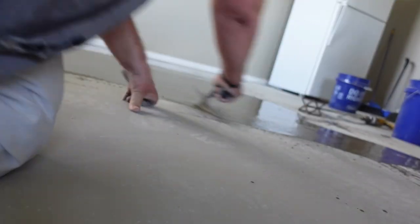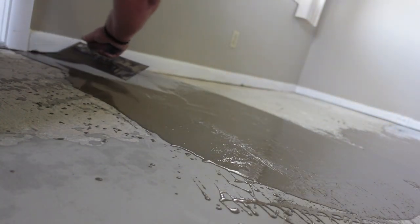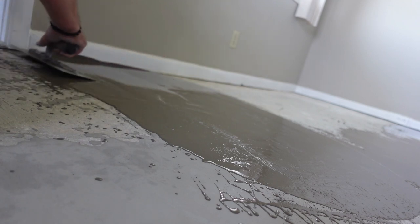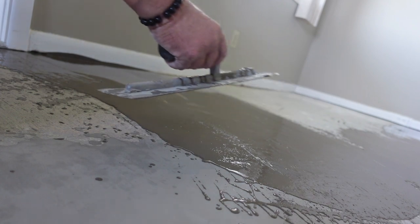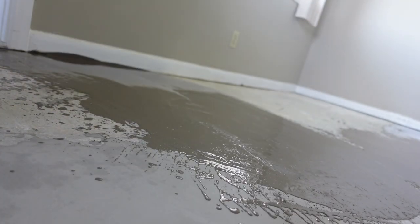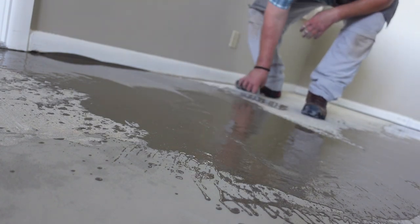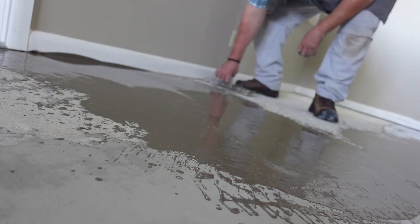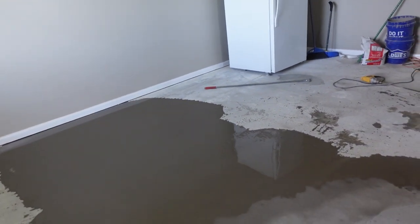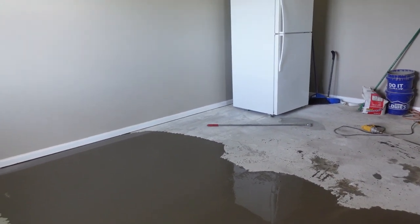At the end, I take the flat trowel and smooth out whatever excess mud we have left over. We don't want to leave any edges — we want it all to be nice and flat. I call it zeroing it out, so that it's smooth and you really can't tell where it ends into the old concrete floor. I'll also put a link in the description to a giant 150-gallon mix bucket I use a lot on jobs where you have a lot of mud to pour. As long as you mix your mud right and keep it flowing, that straight edge does all the work. That self-leveler levels itself out so nicely when it's all done that it makes it look like a sheet of glass.